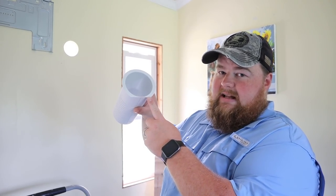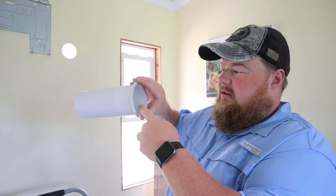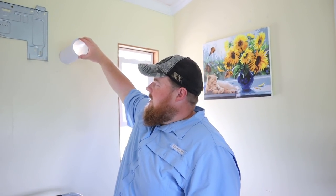With everything drilled, the next thing to do is install the wall thimble. This comes not in the air handler unit box, but in your line set box — the box that has all your giant hoses and everything. You install the tube from the inside towards the outside, and once it goes through your wall you trim everything to fit outside. The thimble comes with a flat part cut on the round — the flat goes towards the bottom so your air handler sits over top of it with no problems.